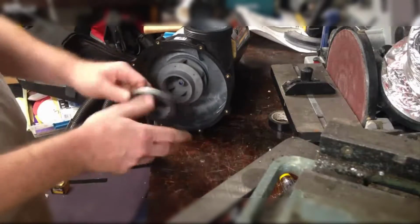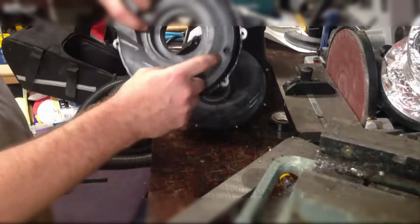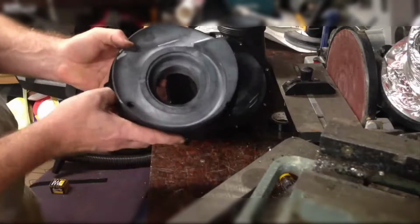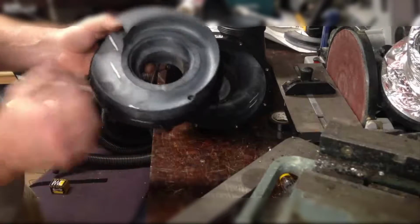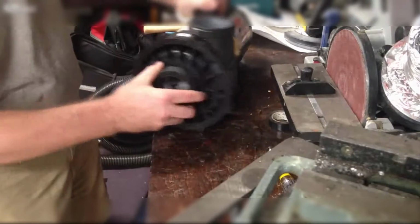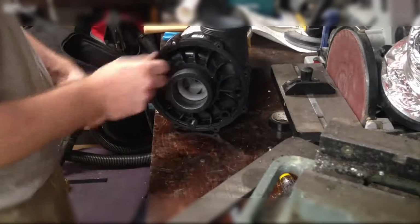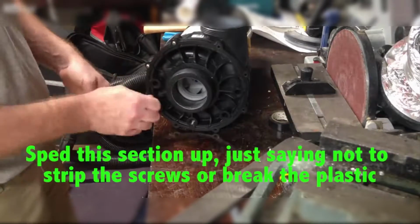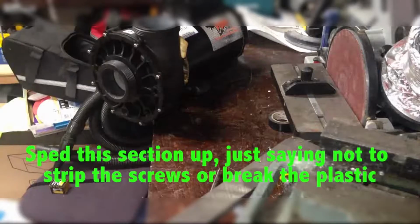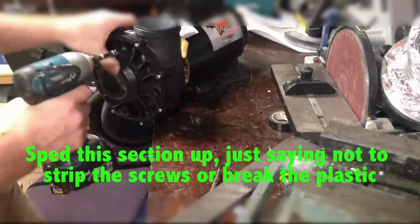Put this little plastic doohickey thingamabob. This particular one's got a hole on the bottom, it's threaded for whatever. So to make sure my O-ring is greased up, seated properly, otherwise it'll leak out of that, and then you just lose water unnecessarily. So put that on the right way. And get these screws threaded in by hand first. And we'll just get the driver here, make sure we're nice and seated and nothing's coming out.